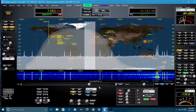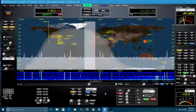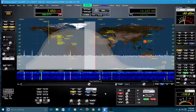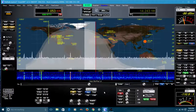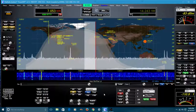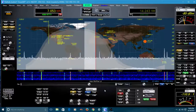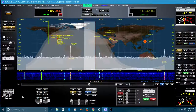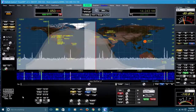You'll also notice a little text down here that says Auto Waterfall Pan Level. A lot of times when you switch antennas, the waterfall will be either too much gain or not enough gain, so the signals don't show quite right. If you right-click it, it automatically adjusts to the proper gain. He's also added temperature indicators and voltage indicators so you can see what's going on with your CPU.